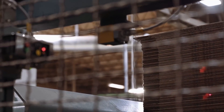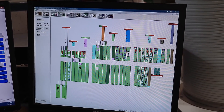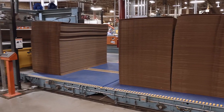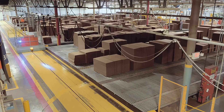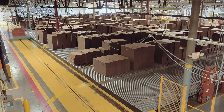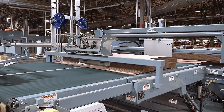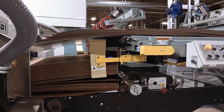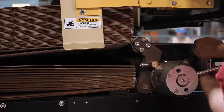Through a series of lasers and optical sensors called photo-eyes and communication between an inventory management system and real-time production scheduling, material is transferred to each machine center onto an infeed conveyor. Automatic transfer carts keep each machine fed with corrugated sheet stock. Each stack is broken down into smaller sections, called blocks, and shingled individually to a feed table. The sheets are fed via a set of feed wheels that work in conjunction with feed rolls that insert the sheet in the machine.